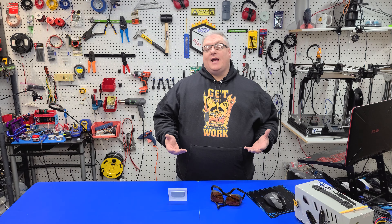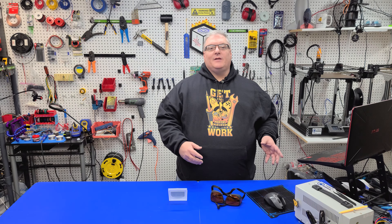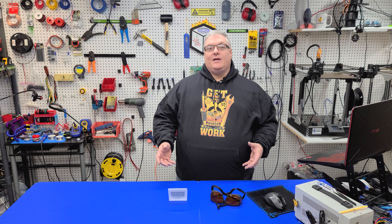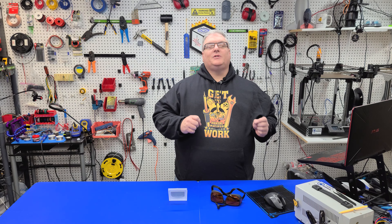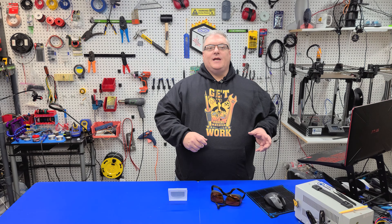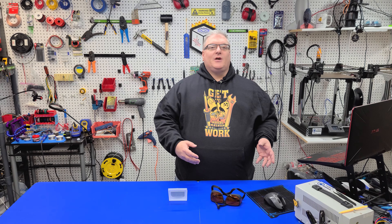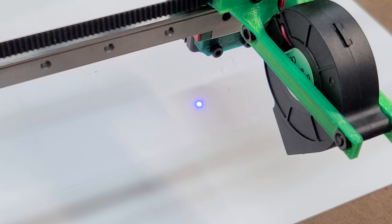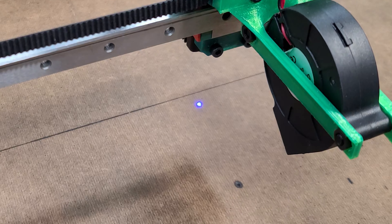What I find as a real difficulty in trying to focus diode lasers is that depending on the material that you're focusing it on and the amount of light bleed you get from a diode laser, it's very hard to see and get a really fine focal point. The reason is because of all that light bleed — when it hits a material, that light is diffused through the material, making things like paper or cardboard very difficult.